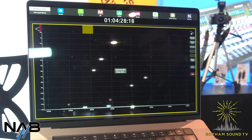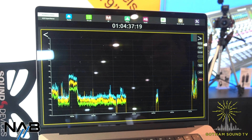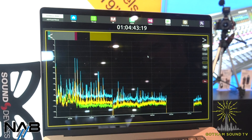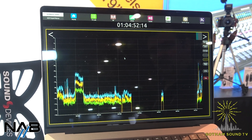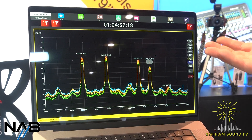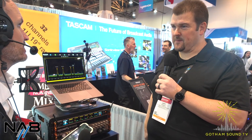We'll take our scan and step up to 600 meg, where you can see why we selected duplex gap. We can also step all the way up to 900 meg and look at STL band, which interestingly enough at other trade shows tends to be more wide open, but here we've got a lot of broadcasters using STL band. That was our reason for going into duplex gap — we're the only four transmitters on in that 10 meg of spectrum. The magic of spectrum and tuning is you can show up on your location, look at your entire tuning range, and pick what's the cleanest, quietest spectrum for you to operate in today.